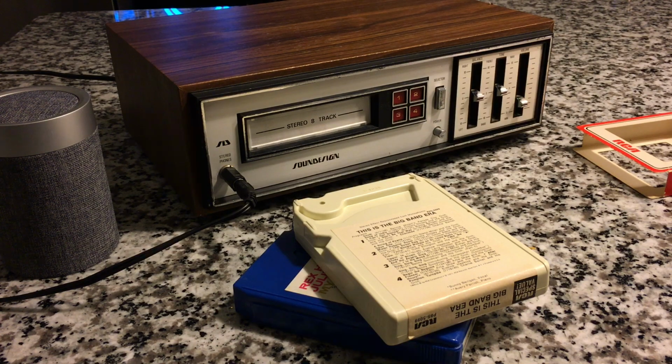And it pulls the tape out of the inner side of the spool and then feeds it back around the outside. The spool there is passive. It's not driven. There's nothing there. It's just free spinning. All of the movement is done with that capstan and pinch roller. And then it feeds it back to the outside of the tape. So as you can see, you can't reverse. You can't rewind. That wouldn't make any sense.